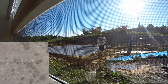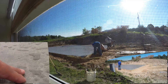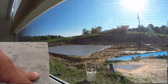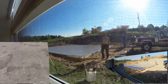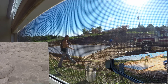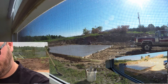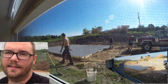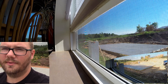I ended up getting the fiber concrete instead of regular. And when they sealed it, I can feel the fibers. I was warned about that — not by these people; these people said it's a lot better. But lots of people told me I'd probably have to go over it with a weed burner and burn off all those fibers so they don't end up in my feet. I'm going to walk on this barefoot, and so are my pets. But having another couple hundred dollars in it being sealed already, I'm not sure I necessarily want to burn it off. I'm not sure how that's going to work out — I guess we'll play that one by ear.